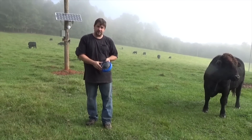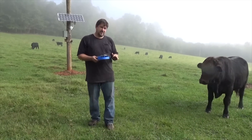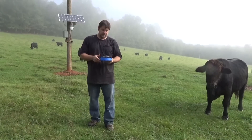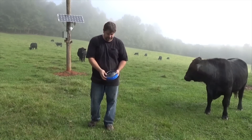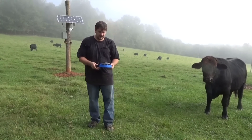I'm using the Solar Pathfinder to determine where I want to put my arrays for a lot of different reasons. I want to put my arrays where nobody can see them from the road, and I'm not looking at the backs of them. I'm also using the Pathfinder to do the shading analysis, so right now we're cutting trees down based on what we see.